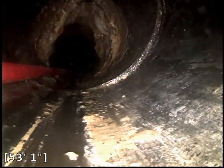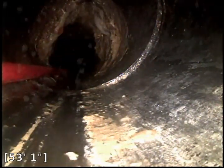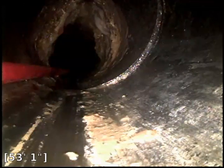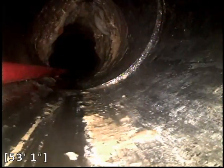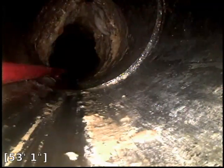It's possible a flex shaft chain knocker system might get through, but it's going to be really rough. There is a crawl space under that part of the house and the homeowner says it's accessible from the garage. You could always add a Y junction or T into the line and bring that over to one of the vents on the front of the house under the kitchen window and put a clean out in, if you started to get a lot of stoppages and it needed to be cleaned out in the best manner. We can't get a camera through there right now, but it is all newer plastic, so that is a good thing. We've verified there is no clean out for the kitchen — nothing on the exterior wall outside and nothing under the kitchen sink to utilize for jetting or chain knocking, which are the best two systems to clean out heavy buildup from a kitchen line.